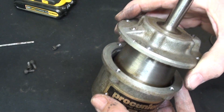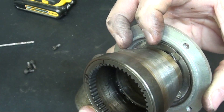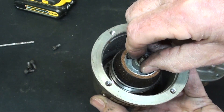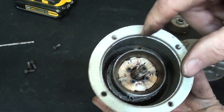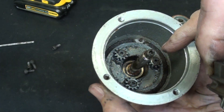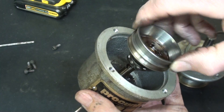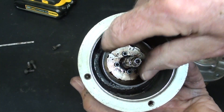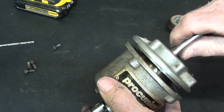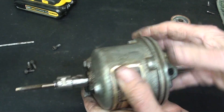To review the lubrication: when assembled you squirt just a little bit of 20-weight oil in there, it comes out and drips down and gets slung out by centrifugal force. Most of it ends up at the bottom — we don't want any on the friction surfaces. I'll put a little grease on those planetary gears on final assembly, which lubricates that lower bearing and those bronze bushings. Turn it just a little bit and you can see the gears engage, and then the ring gear clicks into place.